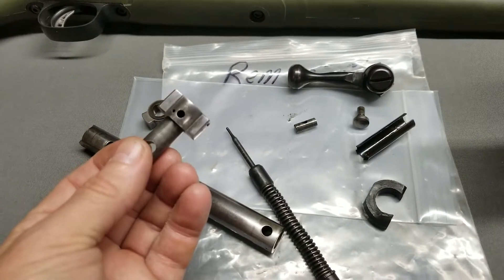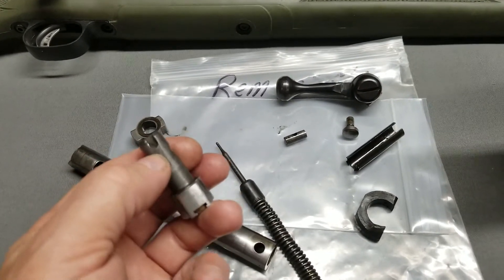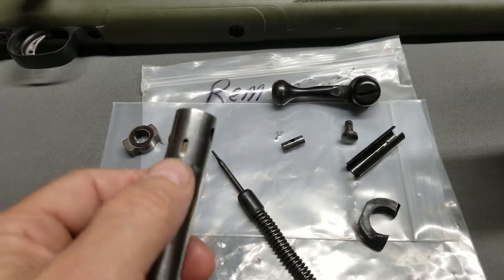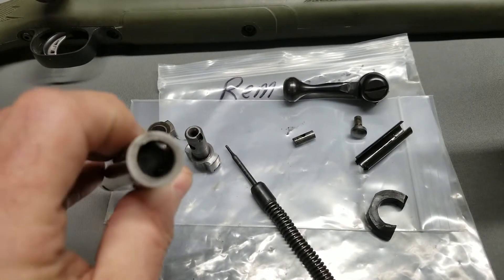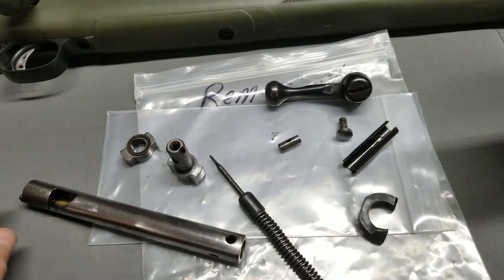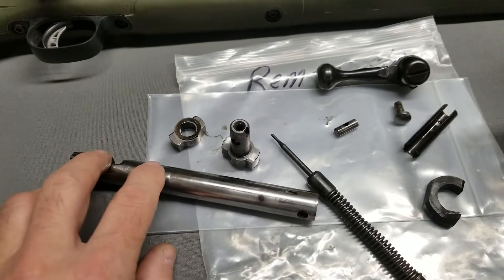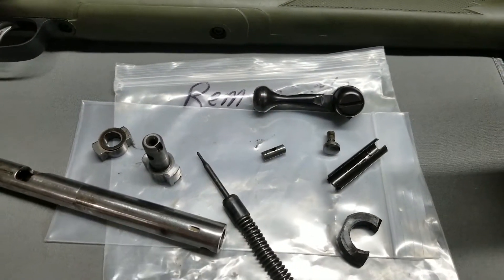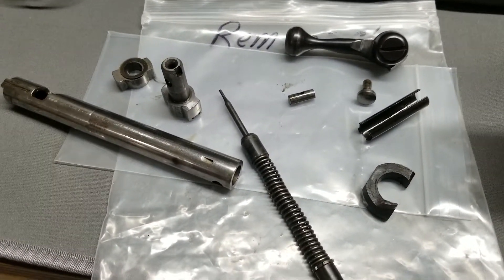What you'll find on the pre-1999 Savages is this particular head has a little machined recess, a little divot here, and it corresponds to the bolt shaft. We simply grind down and machine that out and resurface the area within the bolt body. We'll probably be doing a really nice jewel job on here using our C5 indexer, and we may upgrade the bolt lift to more of a tactical or a larger tactile knob for this particular build.